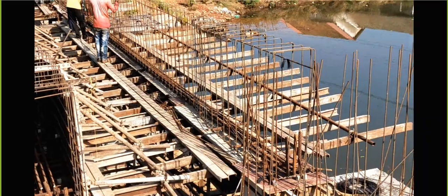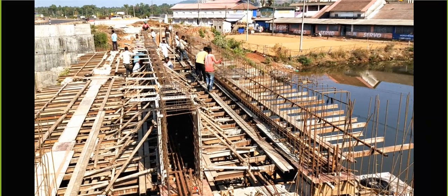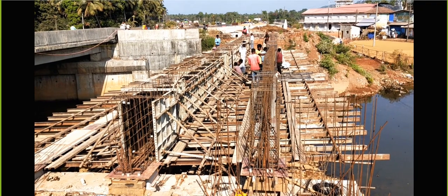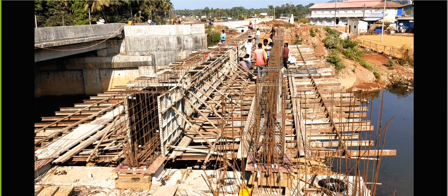You can see how it has been kept - this part is resting on the bearing. The load will transfer to the girder, and from there it will come here and be transferred to this particular abutment cap. That is why we are providing the bearing here, here, and here - that is where the maximum load, stresses, deflections, shock, and vibrations will happen.